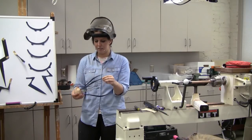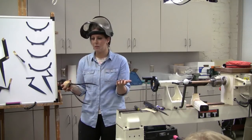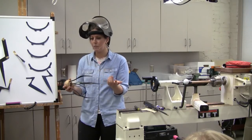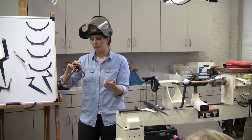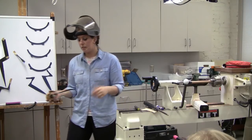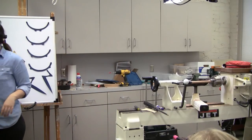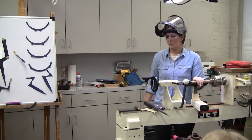I tried to fix it and wipe over new ebonizing solution. I tried to just clean the legs off, but it wouldn't come off. So I just used the black trans tint dye over top of it, and it was fine. So that's actually black trans tint dye with ebonizing underneath it, and that ended up covering really well, too. But honestly, it didn't make much of a difference because it just went from black to a blacker black.